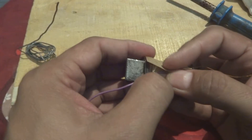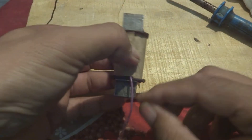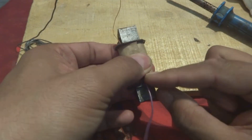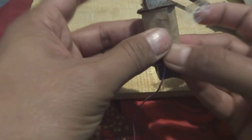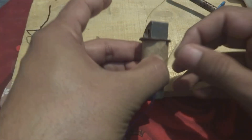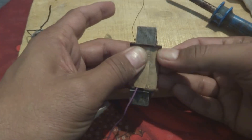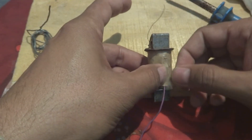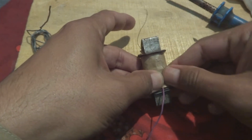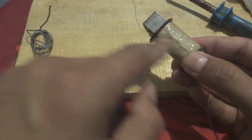From here, I will pull this paper on, and same way I will bring this wire to this place and secure this paper with the tape. This should go somewhere over here, and then the tape will secure it in its place — secured. Here also I would have to put this tape on so that it will be secured. Same way, now again I will complete my winding by 500 more turns and will bring one more lead over here outside.